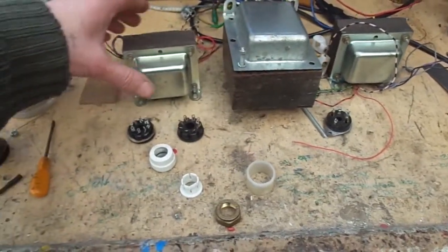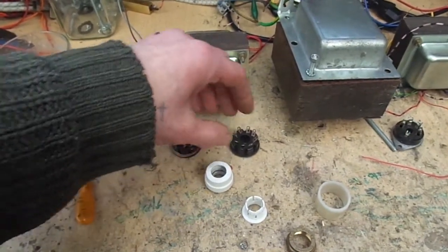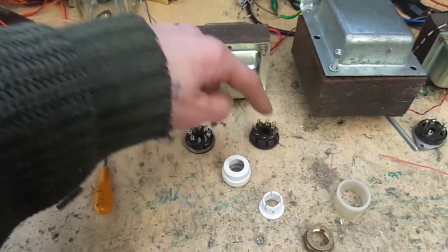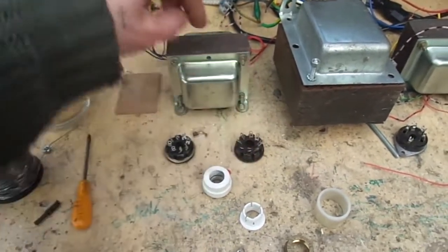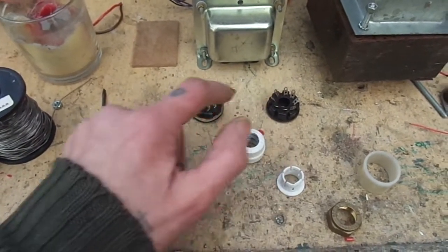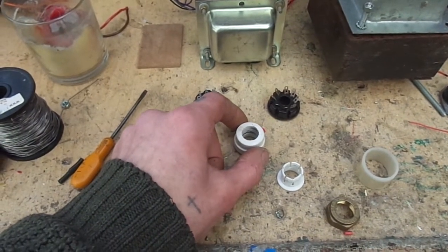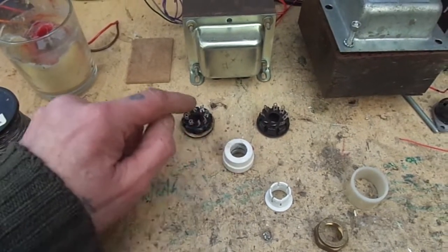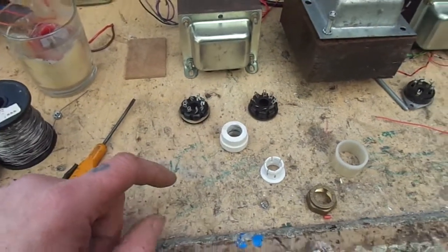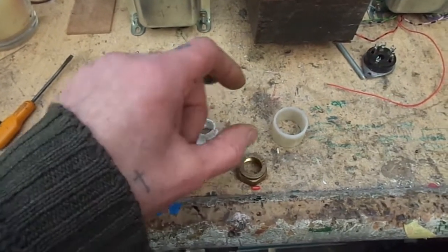But with it like that, and the output transformers there, we've got to try and keep these output valves near to the output transformer. The driver for the 2 output valves, a twin triode cathode follower, needs to go next to them, quite near, so that we've got a small distance for the coupling capacitors and what have you. And then basically all we've got then is the phase splitter.